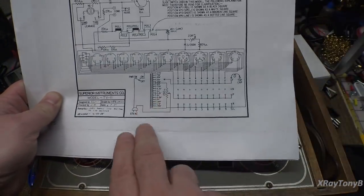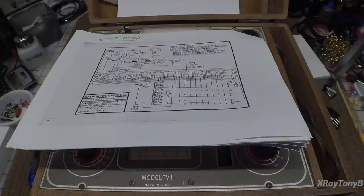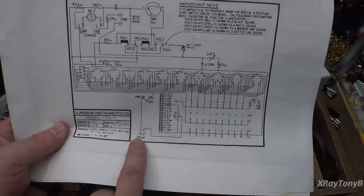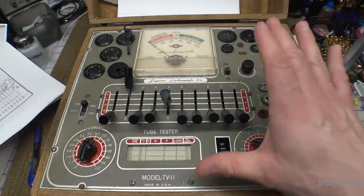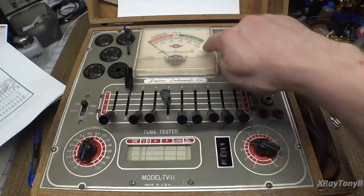You have this 250-ohm resistor in here, and you can see that 117 volts goes in right here. It shunts across there and by adjusting this you can adjust your line voltage so that you have more accurate voltage getting to the filaments and your test voltage — which I believe is 25 volts on this one. That will basically give you a little more accurate reading. It's still an emissions tester, still just a zero to 100 scale, and it'll tell you roughly if you have emissions. Once again, it ties all the elements together.